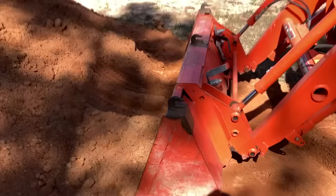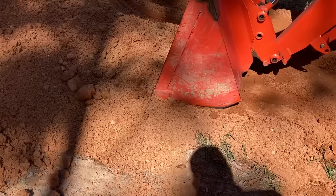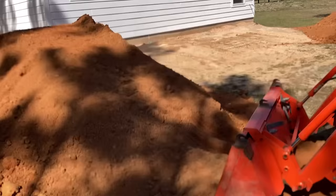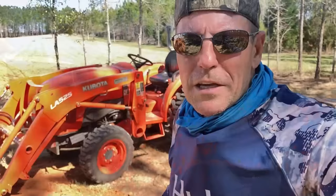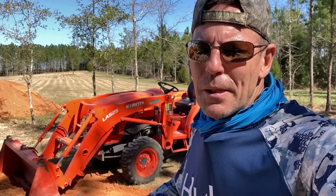Looking at the side of the bucket, I didn't get it completely perfect — I probably could have started my push back a little bit. But you can always forward blade the dirt back into the pile and get another bite. When you have a nice big fresh pile it's not as critical. During cleanup time you've got to get the bucket fairly straight so it doesn't dig a hole under the pile, and it allows the tractor to push in and fill the bucket completely — more efficient with a full bucket.